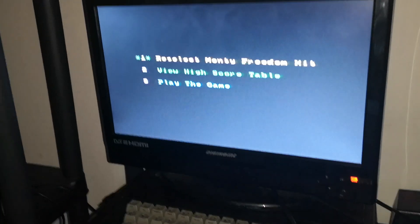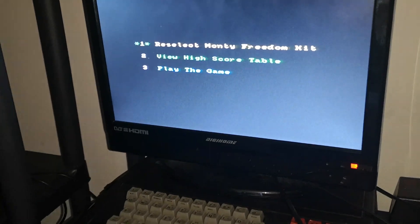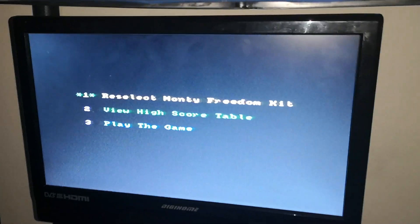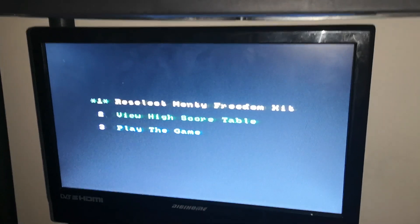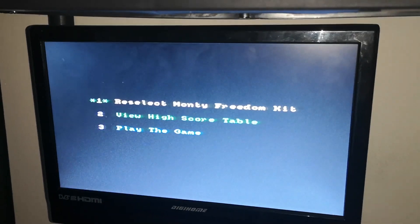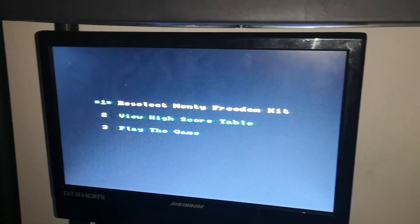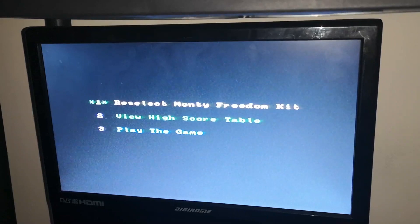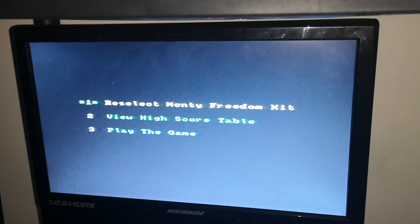The other thing you can see is that fixing the earth problem on the tape deck gets rid of any banding or lines when it's playing music. Normally, if you've got an earth problem, a good indication is that you'll have banded lines coming across the screen and the screen goes a bit fuzzier. So if your machine starts doing that, check the earth out and re-solder a new connection if needed.